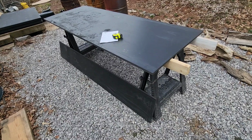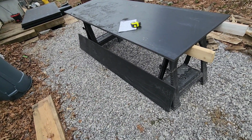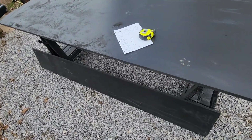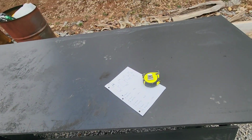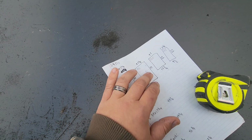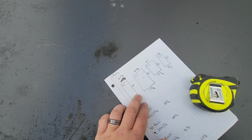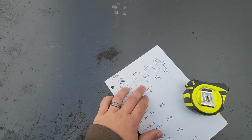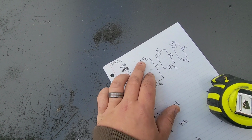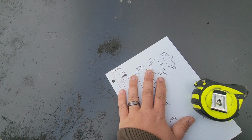All right, so we started doing some cutting here. I'm not going to go over with you how I'm mapping out how to fit my pieces on each sheet. For the sake of time, that's just going to take too much. But I'll give you one example so that hopefully this can help you out. So both my 40 series tubs and my 70 series tubs are 34 inches long. And as I've already stated, we already added in our 1/4 inch width and length and our 1/8 inch height. That way we're not trying to figure that out on the fly. That's already in our measurements.